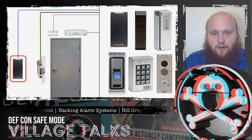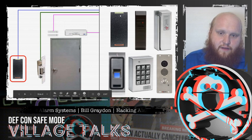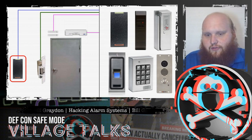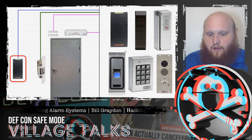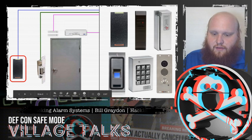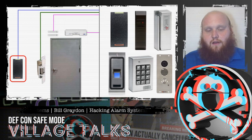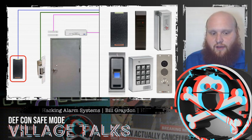Let's look at the technologies available for the credential reader. We have RFID-based, which is the most modern and generally the most secure. We have magstripe — cards encoded with a number in magnetic polarities along the card. We can use a biometric reader such as a fingerprint scanner, a key code entry system where it's something the user knows, or a camera where a human on the other end makes the go or no-go decision of whether this person is authorized to enter the facility.